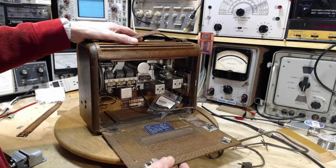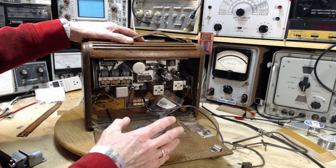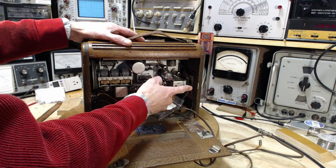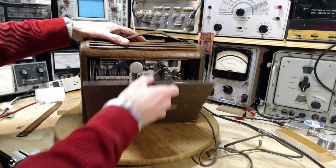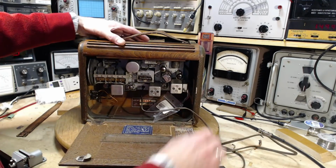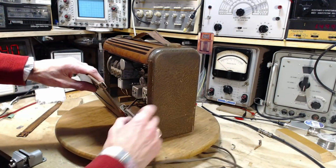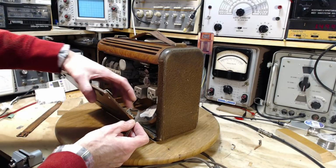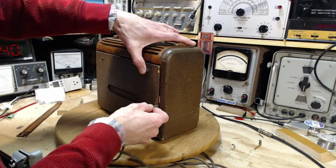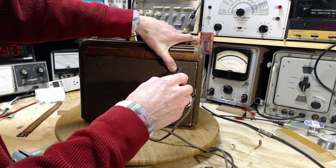So with the door open, the radio is in cord mode because this plunger is not depressed. So in this radio, anytime you open up the back, it's ready to be plugged in. Now I'm going to attempt to do the right thing with the cord here. You put it in the slot, it moves the lever, and then the lever does not depress the plunger. But well, let me tell you, there's like 5 ways this can go wrong in doing this.